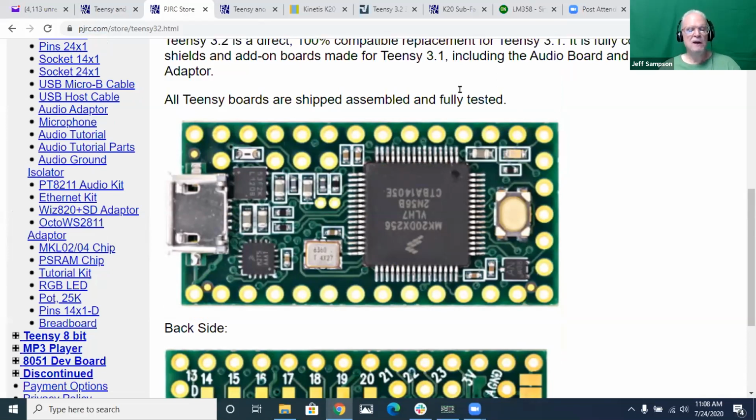But if you do that, if you put the diode on both of those, then you don't run the risk of the servo burning out your USB or your USB burning out your servo, which you could run into either one of those cases right now, or it's simply powering the thing when you don't want it to be. The main drawback to just simply cutting that jumper is that the TNC will run whenever your servo is powered up, but when you've got the USB cable in, the USB cable is not going to power that.